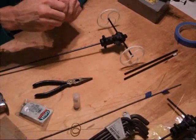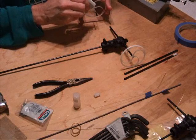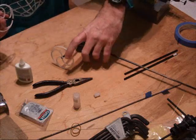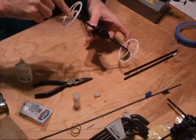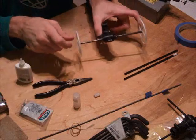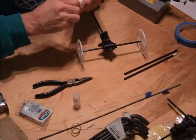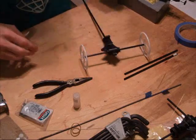To hold that in place, we're going to use some super glue — the CA — right on the carbon axle. We'll just spin that on down in there. The super glue I'm using here is actually a foam-safe CA called Zap Foam Safe CA, which is not going to harm the plastic wheels and such. On this particular part that's relatively important. We'll go ahead and let those set up, and we've got the wheels on our cart.